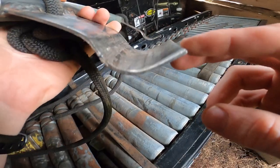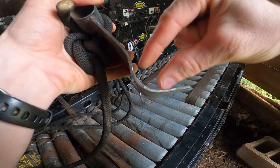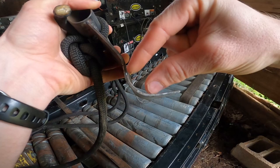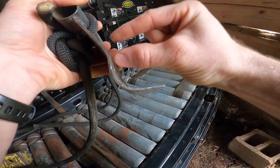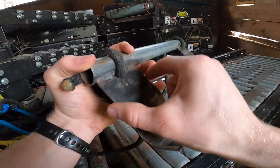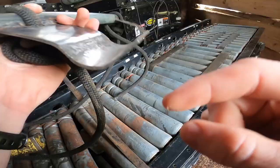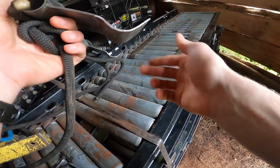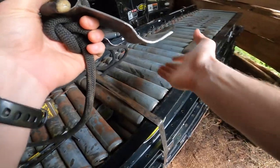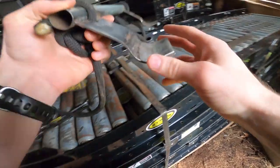For proof of concept, I took a quarter section of pipe with the correct inside diameter and welded it to a one-inch plate here and then a three-inch by one-eighth-inch plate here. I probably wouldn't use this for overhead installs, especially since rollers could pop out of the frame, but for lifting short heights off the pallet it works perfect.